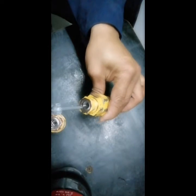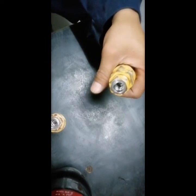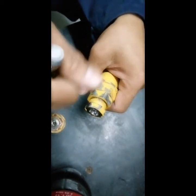I found that this portion had low pressure for the pilot control. Because the o-ring is damaged, the low pressure and high pressure are fighting each other — that's why the control is triggering. The high pressure attacks the low pressure side, and the low pressure tries to control the high pressure, causing the vibrating and triggering.